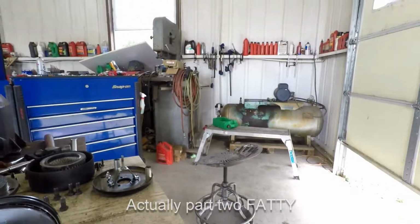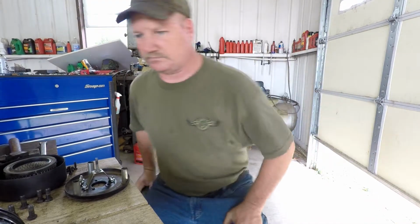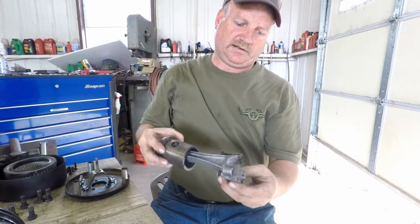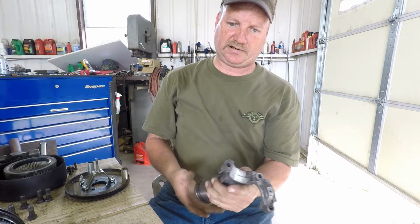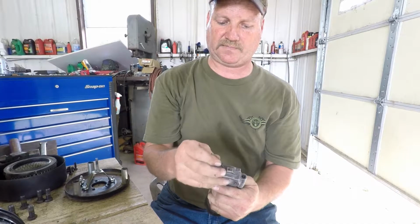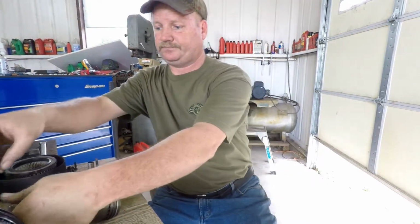So let's see if I can sit down here in my chair a minute. See if I can tell you one final thing in conclusion. Is for some reason we lucked out on this, and all that really happened, this one rod galled, and I think it happened because this dipper that's on here, you're supposed to have a dipper that's kind of in there at an angle, I think. It scoops oil up, pushes it into this groove, and we were able to clean the crankshaft just fine.